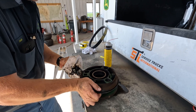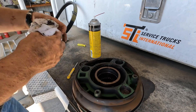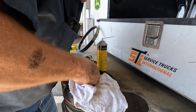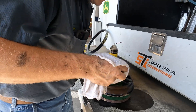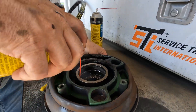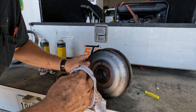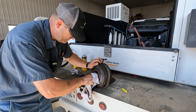As you can see, the seal no longer held the grease in where it was supposed to. This area is supposed to be dry back in here, but as those seals wear, all the grease just oozes out. We'll probably be able to rebuild it this time, but I would say this will be the last time - probably update to a new assembly the next time. This is going to be a two-can job. At one point in time, some of these were filled with oil, then they switched to polyurea grease, and since then we've gone to a synthetic grease.